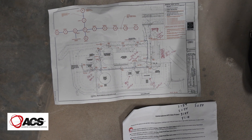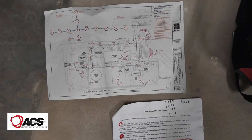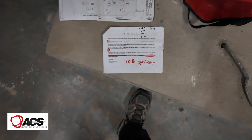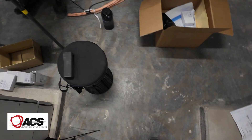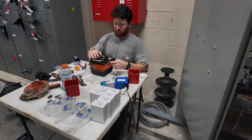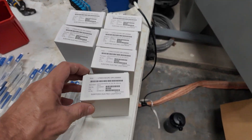Today we are at a water treatment facility. We have four buildings with fiber cables pulled between them. We're making a total of 108 splices. Fiber's been pulled in and Jordan's setting up the splicer. We'll be splicing on SC single mode connectors.